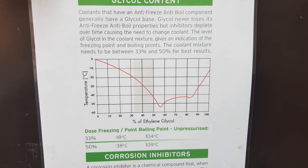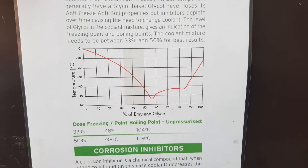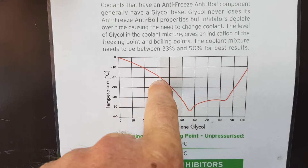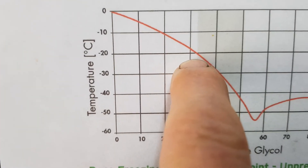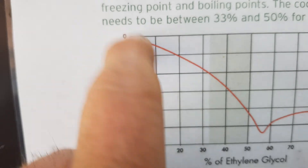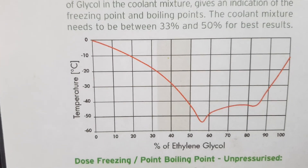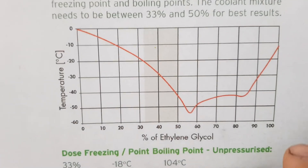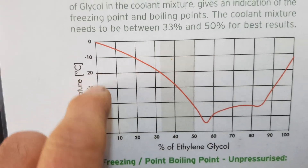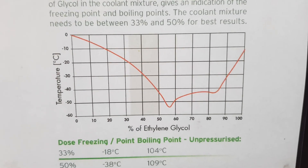This graph shows temperature versus ethylene glycol percentage. The grayed-out area in the center is your acceptable range. You start to go out of range as soon as you hit minus 20 on the low end. Above zero — well, it can't really be above zero because there'd be no glycol. Your range runs from about minus 43 to minus 45 on the rich end, down to minus 20. We're right in there at minus 39.